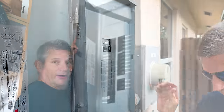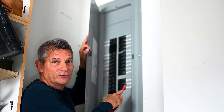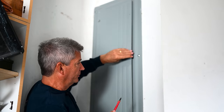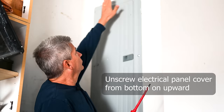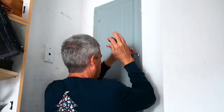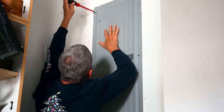We've cut off the power outside. Now we're going to remove just the cover panel. Do not touch anything yet, because we still need to test to make sure there's no voltage in there. Always shut the door so it doesn't flap around on you. Then just start unscrewing — I like to start at the bottom so the last two screws let it hang, making it easier to manipulate. When you get to that last screw, hold the cover with one hand.